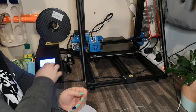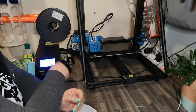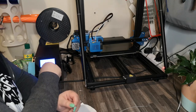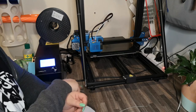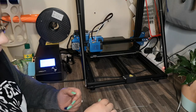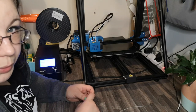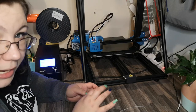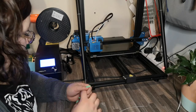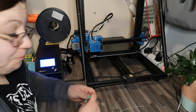So now I'm going to print from the card and it says stamp handle handle G code. So what it'll do now is obviously the bed is dropped to a slightly lower temperature. So what it'll do is it'll now bring the bed back up to 60 degrees. And it'll bring the extruder back up to 200 degrees and it will begin the print.